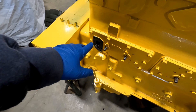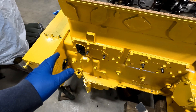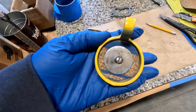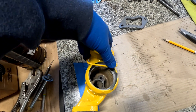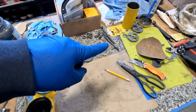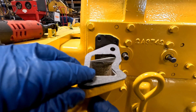We're going to put our oil filler on here so that we can get it on before we put all the decompression system linkage on. Dad's working on that up on the table. He just made a gasket for this where it goes on there, and he's also put a new cork in here for the hinge cover to seal it. I'm trying to scrounge up the rest of the parts — there's a stem that goes up here and a screen filter right here. We'll find that and get that installed too.